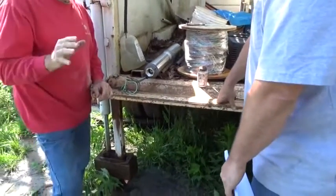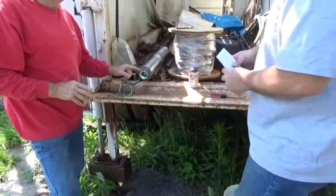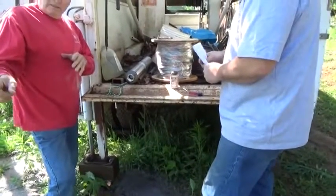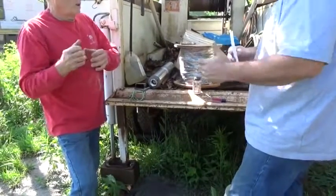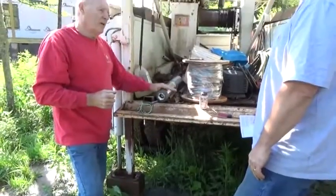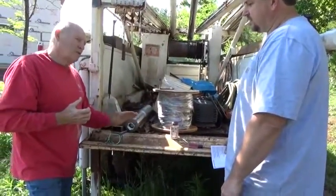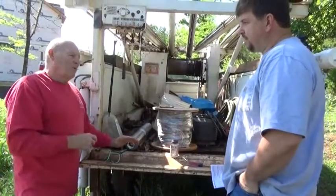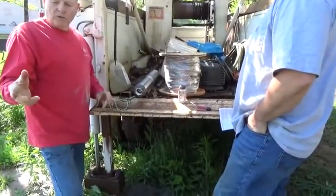On a deep setting, the standard in the industry is a check valve every 200 feet. I've seen a lot of guys who never do it — I've pulled pumps set at 500 feet with only the one check valve that comes with the pump. Without intermediate check valves, when the pump shuts off, the water column drops and hammers the impellers. Over time that does real damage.